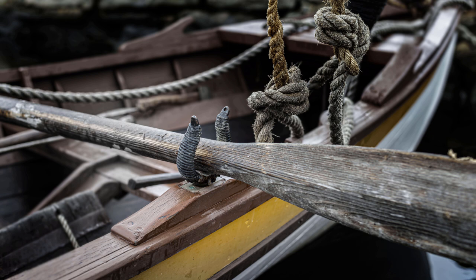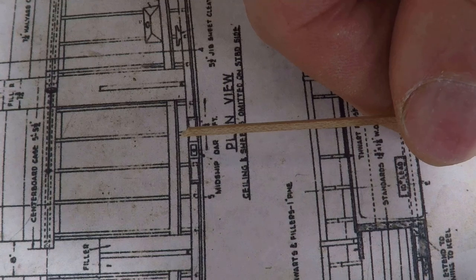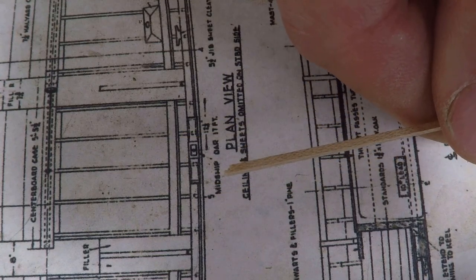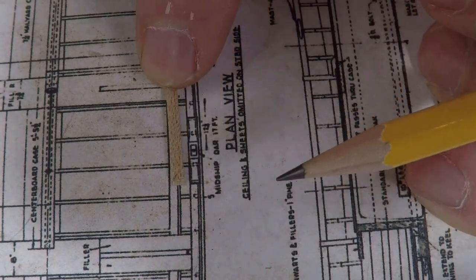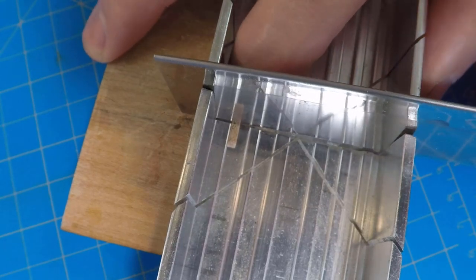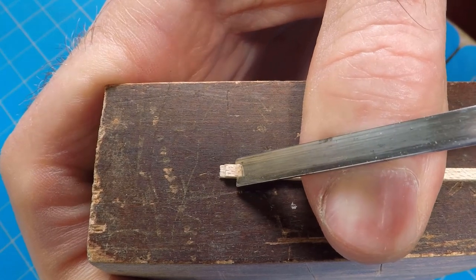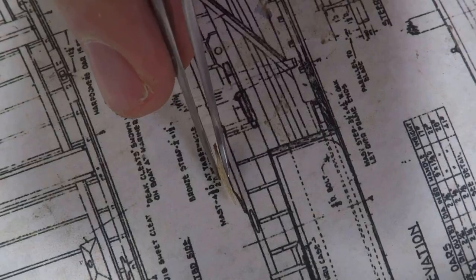I'm sure there are people out there with skill levels higher than mine that could carry this detail off successfully, but for me this was a point of diminishing returns. From the aft edge of the thwart they serve, each of the pads is placed 12 and a quarter inches to the center of the oarlock pad. There are three to starboard and two to port. For these parts I'm using holly, and I've made a blank 62 thousandths wide by 43 thousandths tall. I mark out the length, the four inch flat spot in the middle, and then the hole for the oarlock shaft. I make a saw cut at the two marks for the center, drill a hole for the oarlock shaft, and use a very shallow gouge to pare away the excess towards the ends. I cut the pad free from the stock, check my dimensions, do some final fitting, and repeat the process four more times.